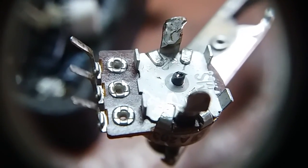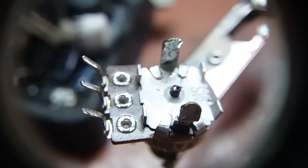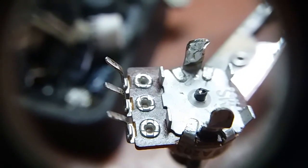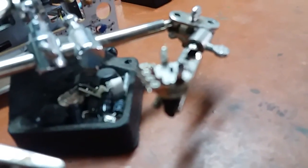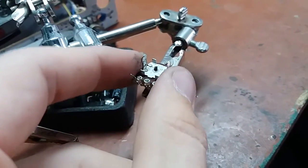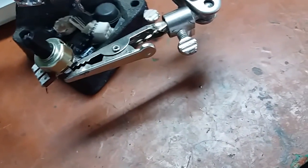So I drilled a hole right where that piece broke off, shoved in a piece of lead cut off from a diode. It's a nice press fit in place, and I put a little bit of heat shrink on there to reduce the play. I forgot what it's called, but anyway, that's to reduce the play. And now it doesn't look too bad. If the damn thing would focus on it, it would be excellent. There is not much play there at all. Let me fix it up so you'll see. You can see now there is pretty much no play. There is a little, but not too bad. We will see what it will be like.